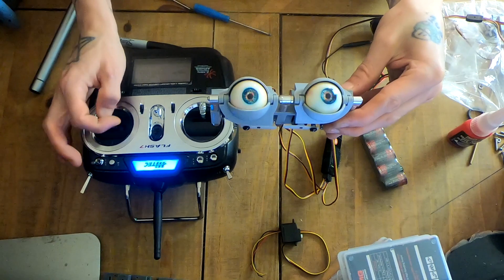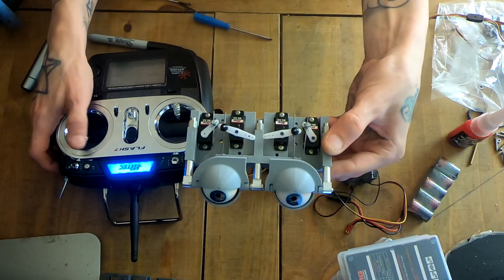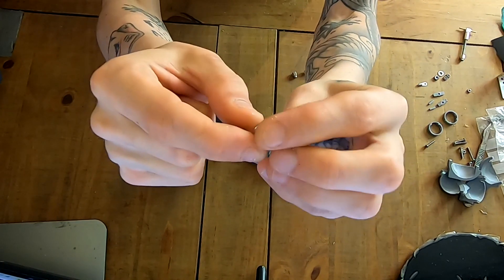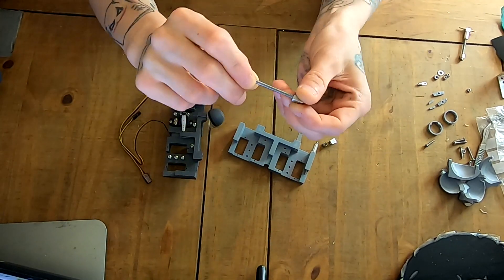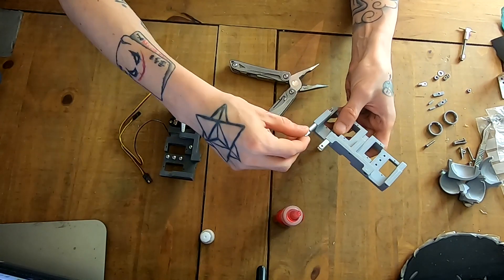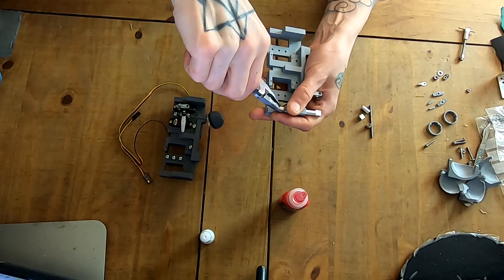Testing some of the tolerances and movements — it's pretty good, reasonably happy with that movement. To construct this thing, these are little D-blocks and I put a bit of brass rod down there, a little standoff and a hex nut in the bottom, and they make some pretty sturdy arms. Obviously there'll be a silicone skin going onto those eyelids so they need to withstand a bit of stress. You get a couple of those either side.